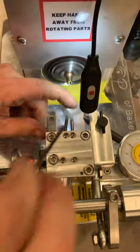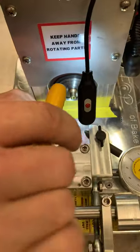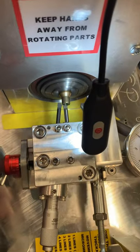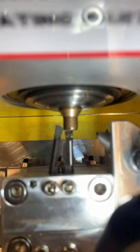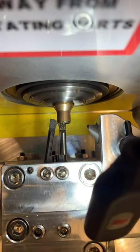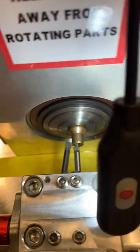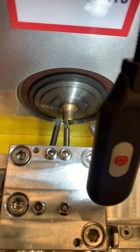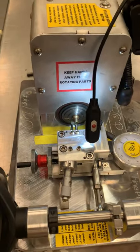I'm just barely starting to cut on the outside. Going another thousandth — you can see we're starting to cut. One thing to note: we've cut that inside about six or seven times now, so the thickness reading we get won't be the same as in normal operation. We have tool deflection plus repeated machining, so it's going to measure thinner now than it will on a real fresh case.